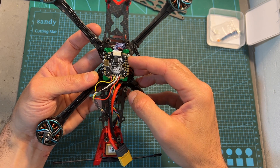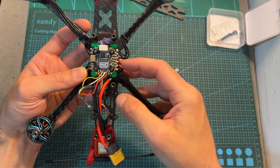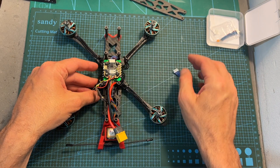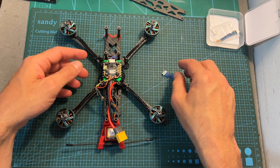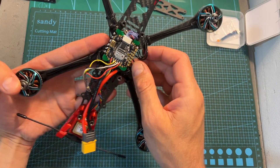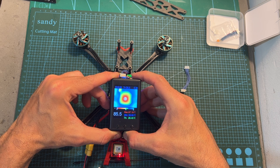The next thing I've done is assemble the flight controller along with the 4-in-1 ESC on this 5-inch frame. Unfortunately I'm not going to be able to fully test and review the F405 Mini HD2 in this video, because the harness provided with the 4-in-1 ESC — also made by Skystars — is not compatible with the flight controller without modifying the order of the 8-pin connector. Basically, the battery voltage was provided to the wrong pin on the flight controller, and now after rewiring the harness, the MCU is getting extremely hot, so although it's working, I can't trust this flight controller anymore.